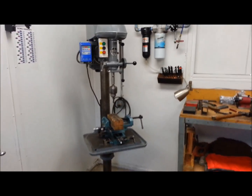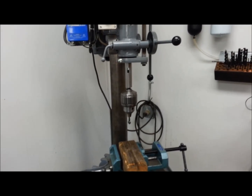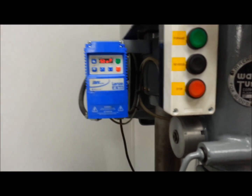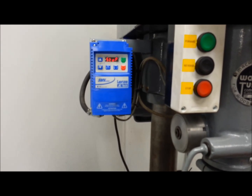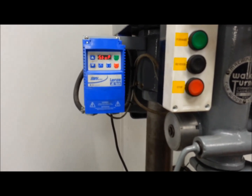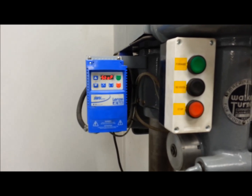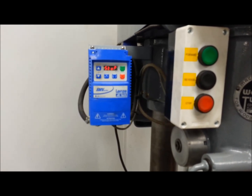Say you're tapping, making a heavy cut at low speed, or drilling something large. You don't want high speed for that, but you need to remove quite a bit of material and the machine needs more torque at low RPMs than at high RPMs. The vector controls will do that for you. There are two types of drive programming: variable torque and constant torque. Variable torque would be used for a blower, because as RPM increases so does the load. Constant torque would be for something like a conveyor, where it always has to move the same weight no matter what.